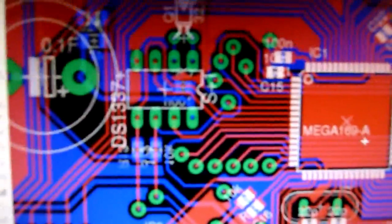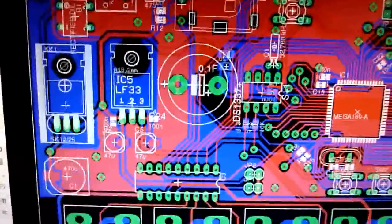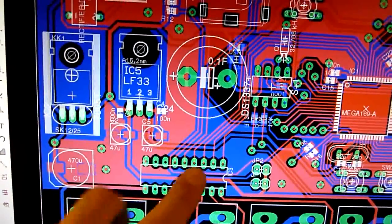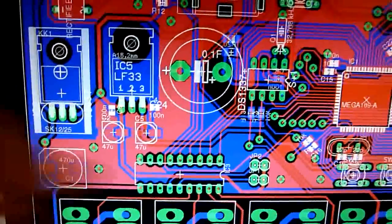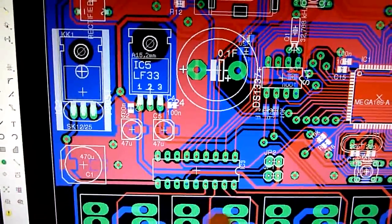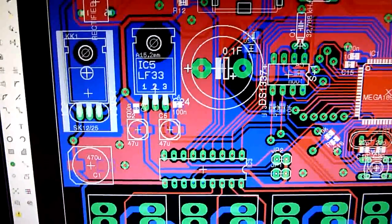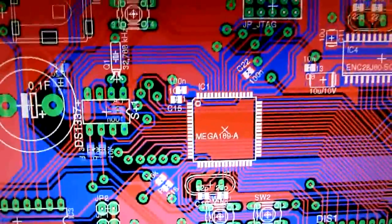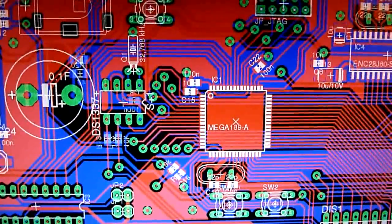Always consider that you have to populate the board — don't make it too crowded. Especially with a mixed layout, I have some THT elements on this board, those huge through-hole parts. I do this mostly when I want to socket the parts; if a transistor burns out due to overload you can simply replace it. Replacing an SMT element like the CPU is a lot harder.